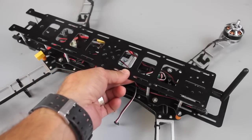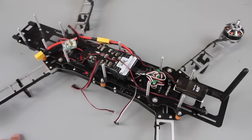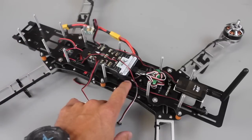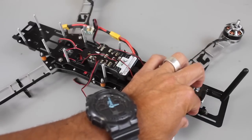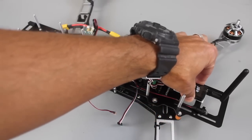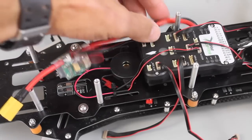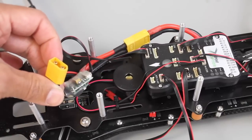Let me show you what I have before I put this top plate back on. One challenge I found with Pixhawk is there are a lot of cables coming out and mounting your components can become a challenge. With this QAV500 frame, thankfully we have a lot of mounting space. I've tried to preserve enough space up front for FPV gear when we get to that point. I've run the toggle switch down here and zip tied it so it's accessible in the back. For the 3DR telemetry radio, I just have some 3M double sided sticky tape holding that down. Up front I've stuck down the buzzer - it really doesn't need to be in a place where it's very accessible. And lastly, I've plugged in the power module. I'll zip tie this cable to the rail and then our battery will ultimately sit on top.